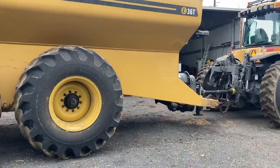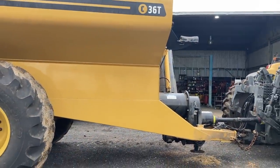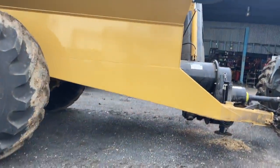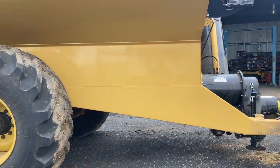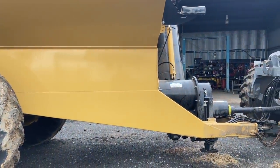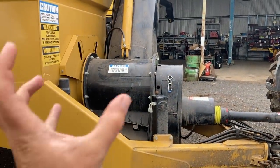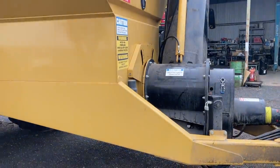We've just got a few things we're trying to improve. We couldn't quite get the claimed output of the auger — it's a 24-inch auger and it was meant to be getting about 18 tonne a minute, but we're only getting around 13. We tried a few things — tried to speed up the cross auger, tried to open up the chutes just to let more grain in, but that didn't really do a lot. The next thing we're going to do is put a bit more flighting just down here in the bottom section at the start of that upright auger, so it helps get a bit more grain started before it goes up into the tube. That's the next project to try and get it pumping out a bit quicker.